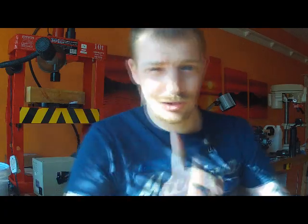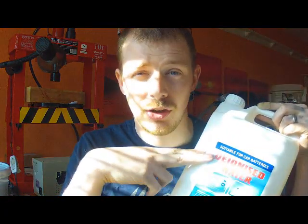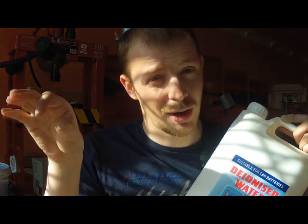It's been anodizing for about an hour now, so it's got a nice good coat of anodizing layer on it. Basically we've just made a big metal sponge — this stuff will soak up pretty much anything it touches. We're going to remove it from the acid bath and put it straight into a wash tank to get all that acid off it. Stick with deionized or distilled water — there are no impurities so it won't affect the finish. Then we'll get it ready to put into the dye bath.